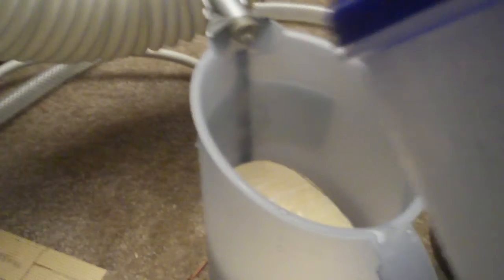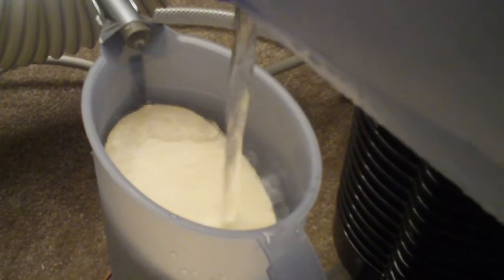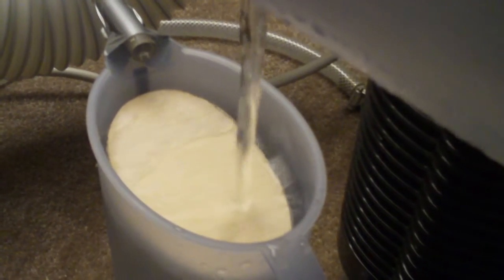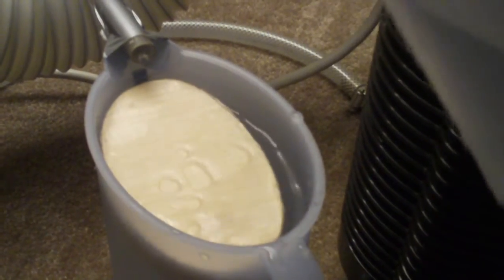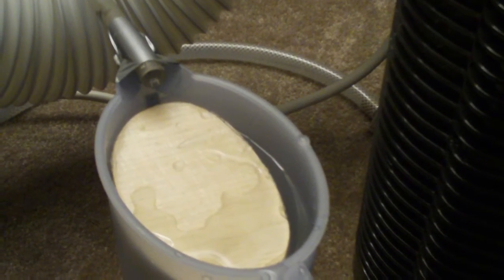What we'll do here is we'll simulate a pump failure by unplugging it. So now the pump is unplugged — it will no longer work. What will happen is we get too much water in the system. Basically, if the pump fails in any kind of way, this thing will get up towards the top and it shuts off the air conditioner, so that way I don't end up with water all over my apartment.